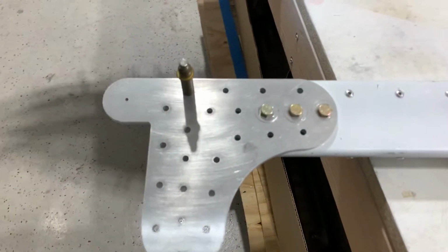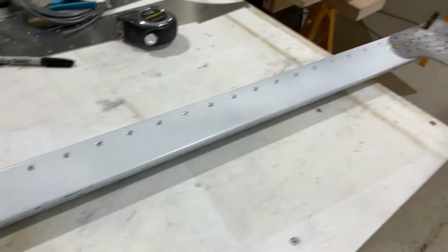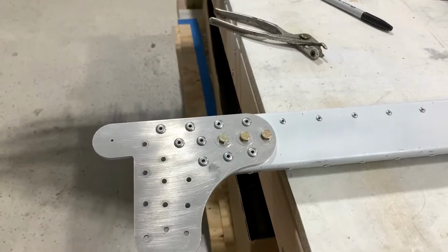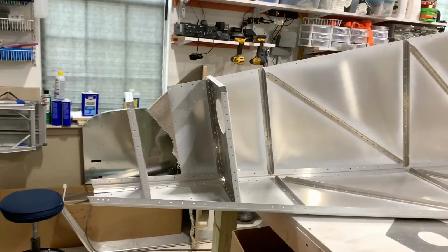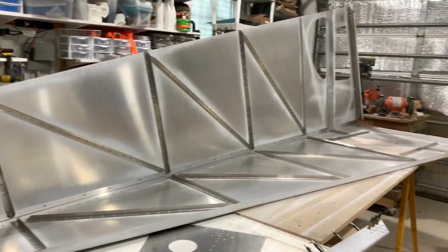There is an attachment plate that gets placed on the square cross member. You need to pay attention and put the three bolts in before putting the rivets in. The holes in the bottom of the plate get attached to a vertical upright channel. Here you can see that the side skin is not as long as the bottom skin and the longerons. There is an extension skin that gets added to the side skin. You'll see this in the next clip.